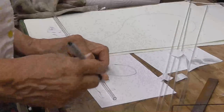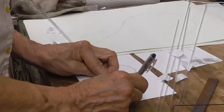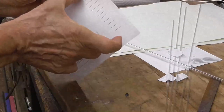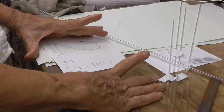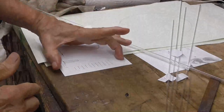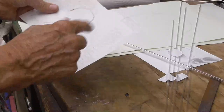See, if I go and do 10, I'm going to just draw 10 here. That's 1, 2, 3, 9, and 10. See, that's going to be the thickness of the stack of numbers. So in an 8 inch diameter, that's still going to fit. If I go much bigger than that, if I try 5/16 tubing, that might get so thick that we can't fit it in the diameter of the envelope. So this is about as big as we can go.